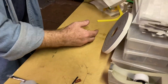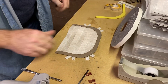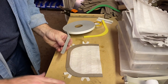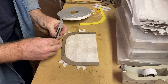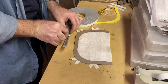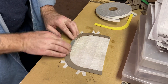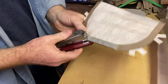I'm going to set this aside and switch to a frame that we've already had glued up so we can keep moving with the video. At this point, I'm going to go ahead and attach the nose piece with the metal reinforcement — again, this is just weatherstripping for windows. We've got a metal piece here that we leave a little bit of overhang on the ends and around the edges. Cut it with a razor blade or whatever you want. Very, very sticky stuff. Then we secure this right here to the frame.